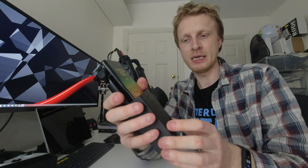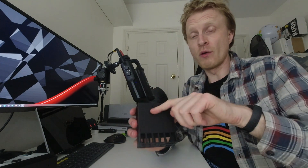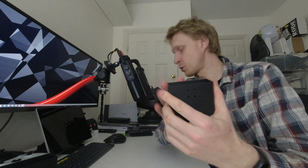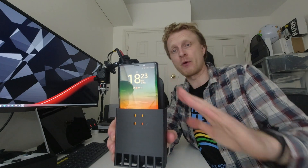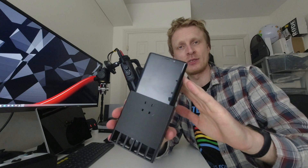There are ventilation holes at the back and front for the DeX pad to suck in air and cool my phone when needed. It worked great, but the problem I discovered with this design is that when the hook is in the middle — the only one contact point with the monitor is in the middle — and depending on where the cables are coming from, the adapter was leaning left or right. So one contact point with the monitor wasn't great.